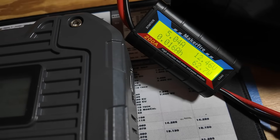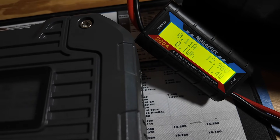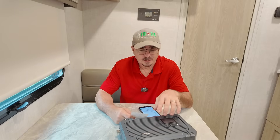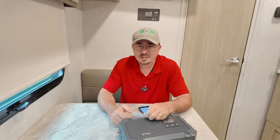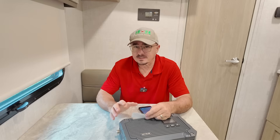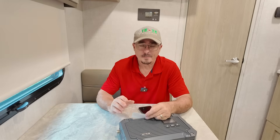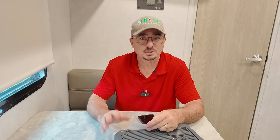We'll have a little bit of runtime considering we're going to be using a 100-amp-hour battery with this unit. I'm going to put a 100-amp-hour battery in place with it and a 100-watt solar panel. That 100-amp-hour battery will give me about 1,280 watt-hours of power. I'm thinking they're going to be using this repeater maybe 10% of the time — I really don't even see them using it that much, but I went ahead and calculated 10% for their transmit time.